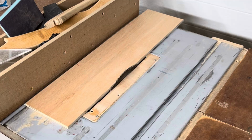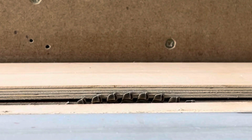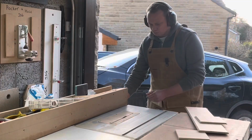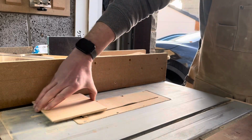I'm going to set my blade half the depth of the piece of wood that I've got. That way I'm leaving plenty of length, it's not a weak point, and also giving that little bit of extra gluing area. To do this successfully, you need to run the piece through multiple times, nudging the fence over a fraction at a time. I also like to keep an offcut on the same material, where adjusting my cut till I've got right fit on something that's nice and snug.